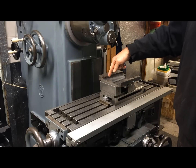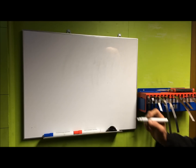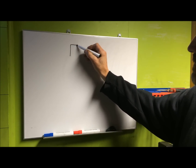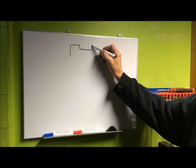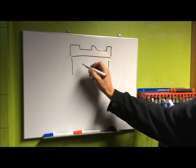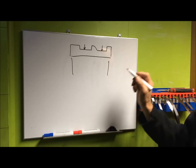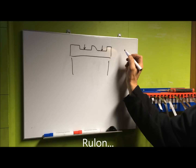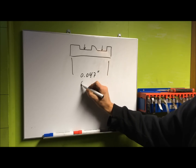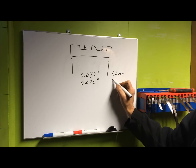I tramped the vise — or the milling vise — to this surface, just to explain the application of Turcite. If I try to draw up a sketch of the saddle as it is on the vise here on my mill, then I will mill down here to make room for the Turcite. The Turcite I bought: one type is 1.2 mm and the next is 0.8 mm.